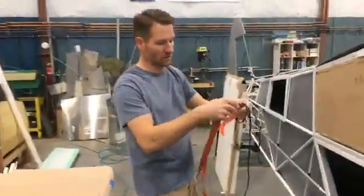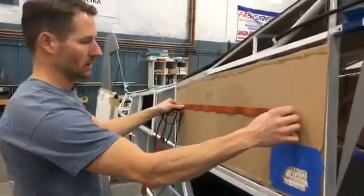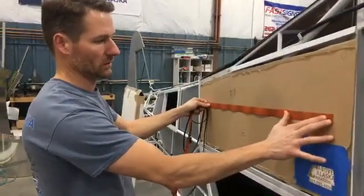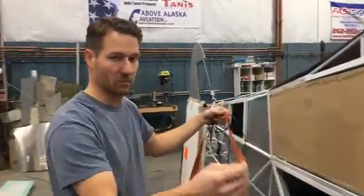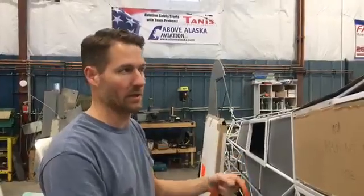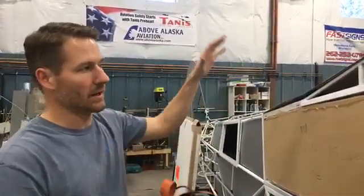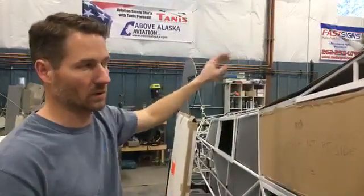And to do that, we use this simple contraption. It's just simply a cord with heat tape, and we lay that out on the glass, and then we mark it, measure it, line it up, tape it all down real tight, and then plug it in, and it gets really hot. It takes about 6 or 7 minutes to heat up to the point where the glass can bend. So we bend it all up, and it's a little bit oversized, so we set it up there after it's bent, and then we mark it all out, and then we cut all the edges,